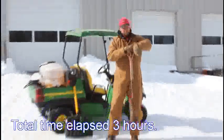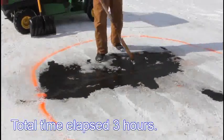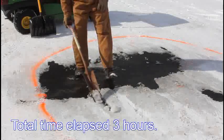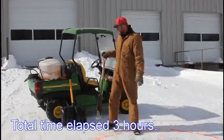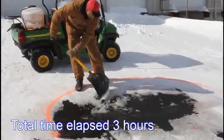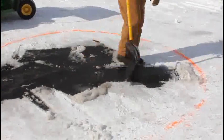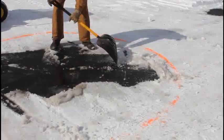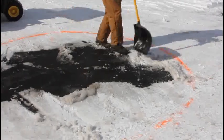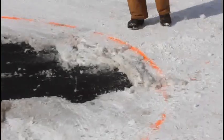We're back out at our test site. It's about five minutes after one and we'll go ahead and take a look at what the stand-up has done. You can see we're down to bare asphalt here, and the rest is soft enough that if you wanted to come back and hit it with a blade — whether it's a box blade or a snow plow — that would easily remove it. You can see where our line is, and that's about where the melting action has stopped. Everything outside of that line is still very hard, very compacted, very slick, and very dangerous.